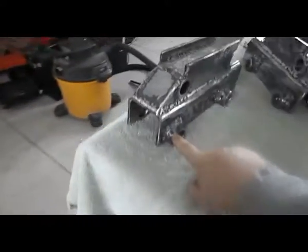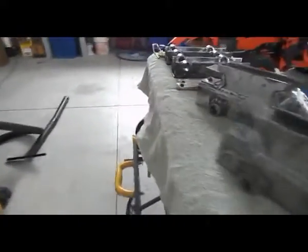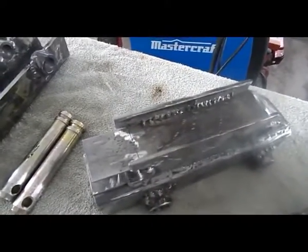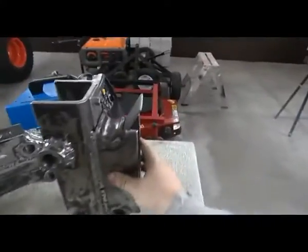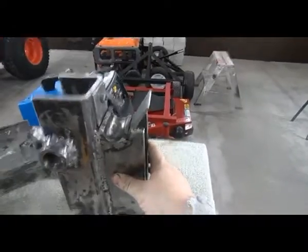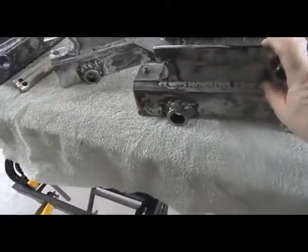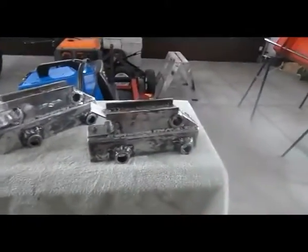I've got the holes drilled for the pins. That was a pain. What I did is I left this one, I had cut these grooves in order to bend this, and that's the stage I'm at right now. When this goes on to grab the bucket, I put this angle there again. I'll show you in a second why. And I put these longer. These were, I think, 3-inch bar. So I weld them at the top to complete the whole thing.